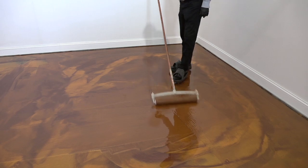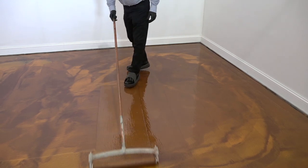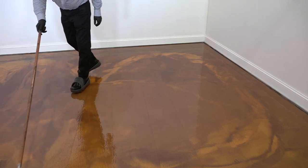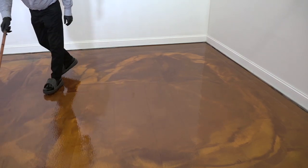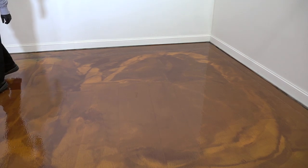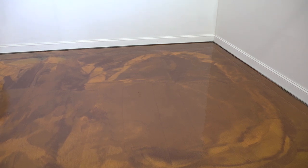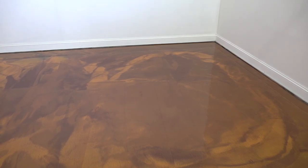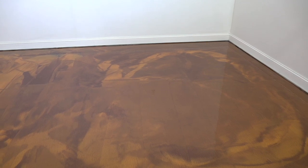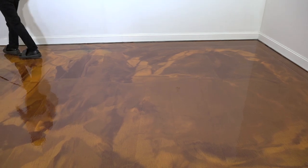And we're using an 18-inch roller, which really we recommend. There's obviously different size rollers that you can purchase. The only size that we sell for this is an 18-inch roller, because this is the professional way to do it. It's also much faster, and it also puts the material out on the floor much more evenly as well. One person rolling with an 18-inch roller is like 3 people rolling with a 9-inch roller. So that's what we sell you. That's what we recommend. It's what we supply in our tool kits.